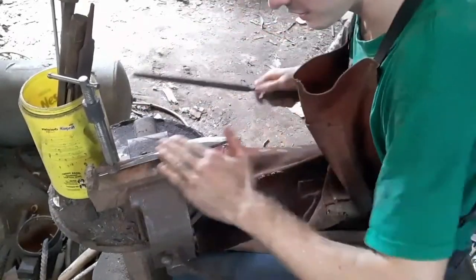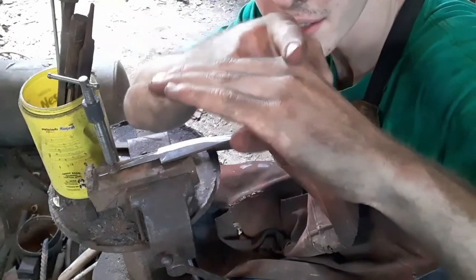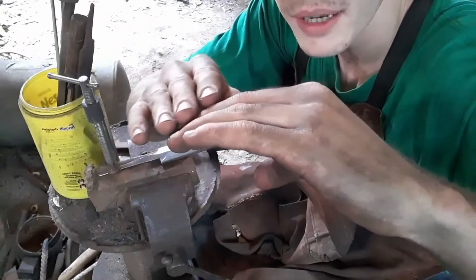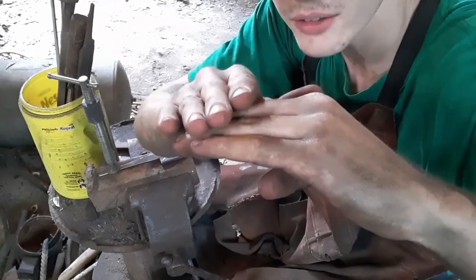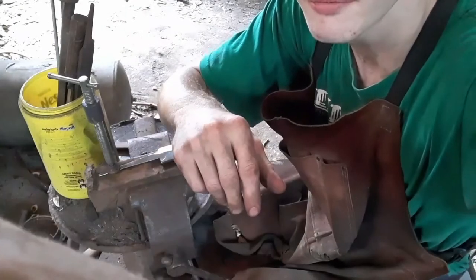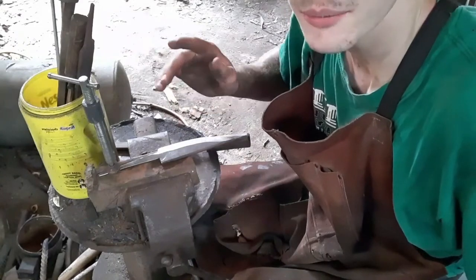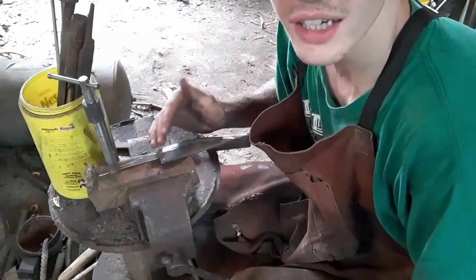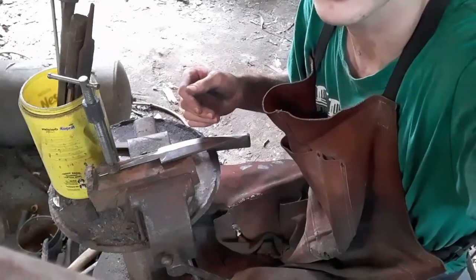I'm just walking it back and forth, making sure it runs all the way up to the plunge line. Kind of scratch all down up in there, because sometimes whenever you grind with an angle grinder, like down here is the edge, and back up here, my knuckles are the bevel line, it can have a curve in it. So what I'm having to do is, down over here there's a pretty nice little rise, but up through here is kind of more flat, so I'm having to walk down this hill to make sure it's a nice angle going straight down. So, going to finish filing this down, and then we'll head to the belt grinder, and then we'll be ready to mount the brass on here. File it to shape and get all hooked up, and then we'll be done after we do the handle and all that mess.